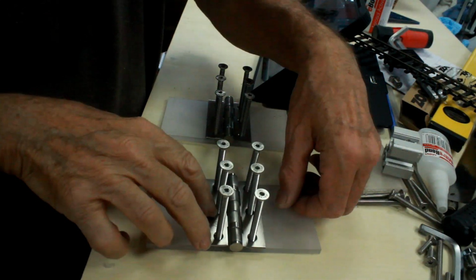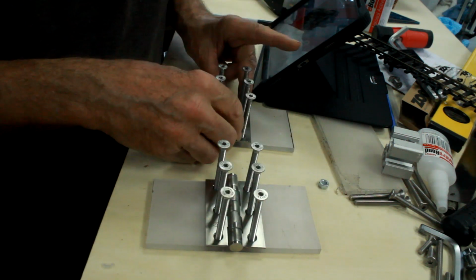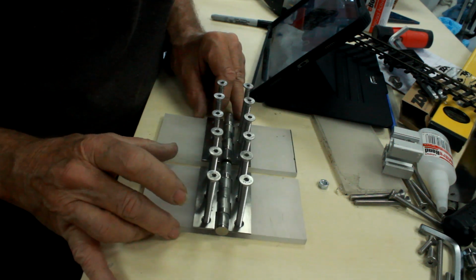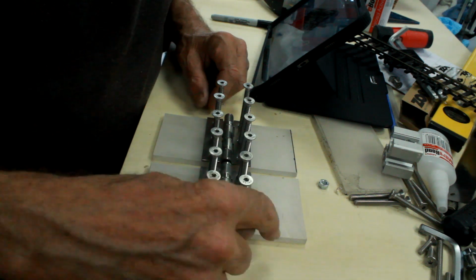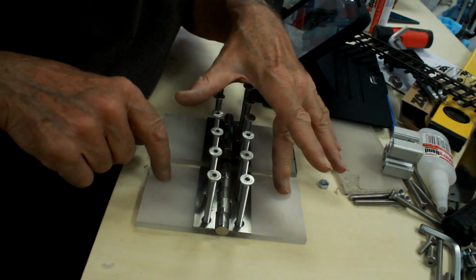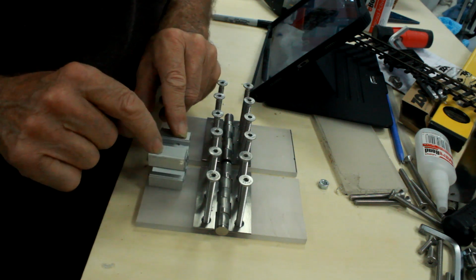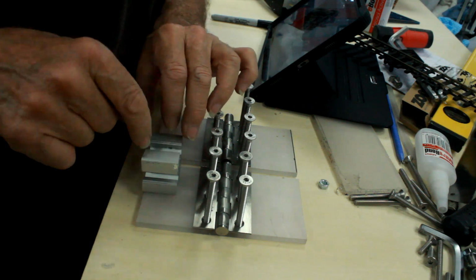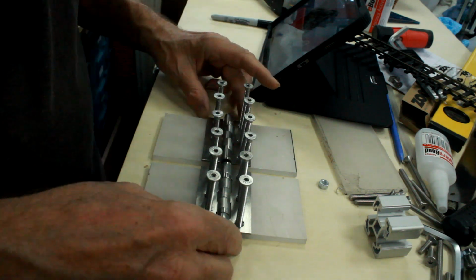That's drilled the holes through from the hinges into the plates, so I know I've got a decent straightforward register on those. What I'll do now is sort out a spacing for some extra holes, probably one either side there, and then one either side on the line of the aluminium. And rather than go in through the sides like those two will, I'll probably go straight down the middle and get a fixing through in the middle of that one. Just spreads the load around a bit.